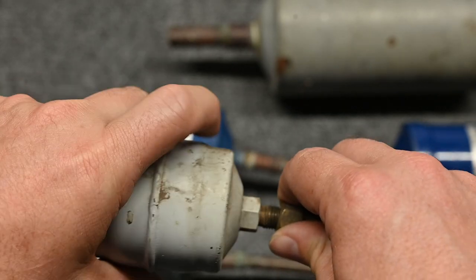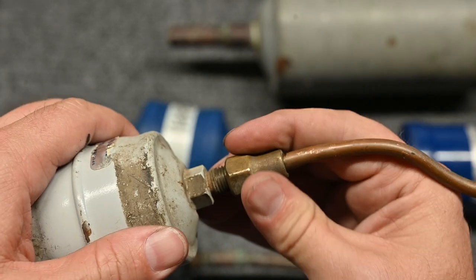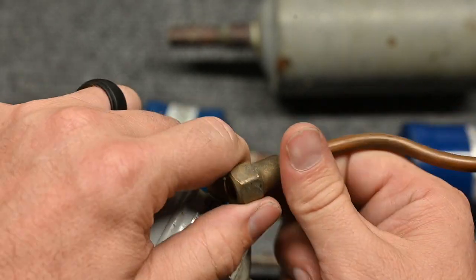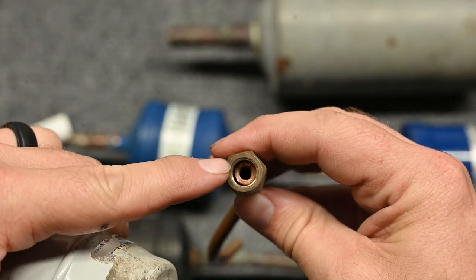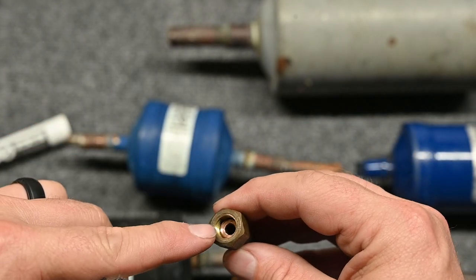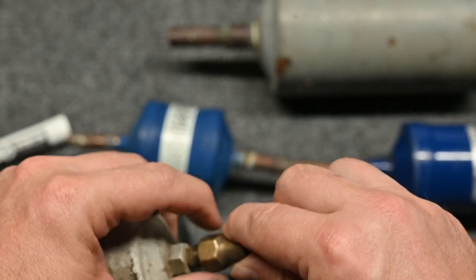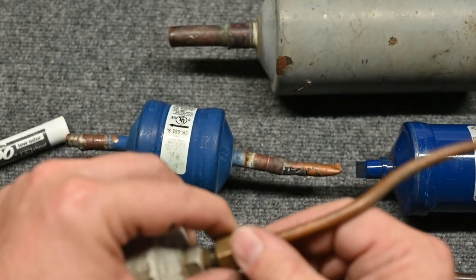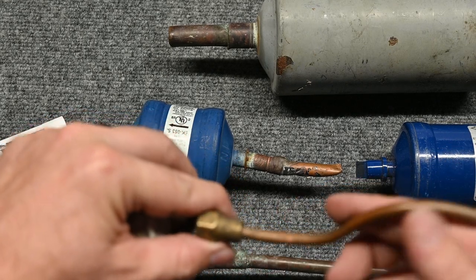It's just the copper that's been flared out — we'll get into flaring a little bit later. But that flare has to be done correct. Also, this has to be the correct tightness. You'll end up with people that over-tighten these fittings. I've seen people say flare fittings notoriously leak, so they tighten them even more. The problem is, if you tighten too much, that copper will start to split, start to spread out, and when the copper splits it will crack and cause the leak. So the people that have an issue with these leaking over-tighten them, and over-tightening notoriously causes them to leak. There's really a torque wrench you should use to get the right specifications.